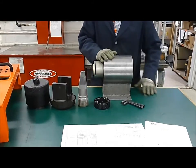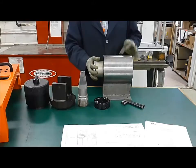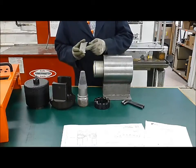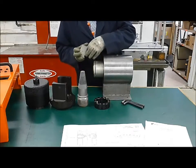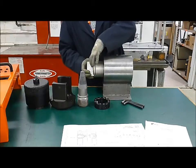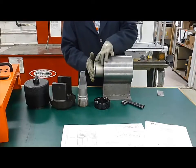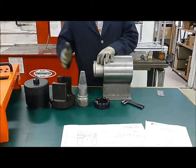The stick-out: when setting this up, you set up the hardware into the flange and check your stick-out dimension. In this case I have a gauge for the 9E — this has a step in the gauge. The ears will sit down on the nut, and the base of it should be resting against the stud. That sets your stick-out dimension between the stud and the nut. This is important — it establishes the distance from the end of the stud to the flange, so when we build up the tensioner on there, we have the proper orientation of everything down the train.